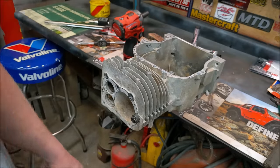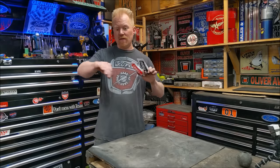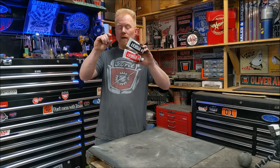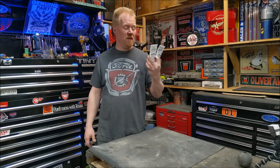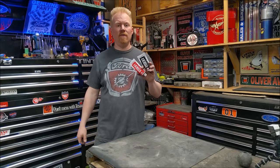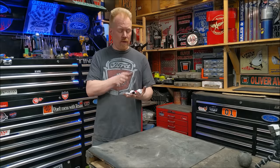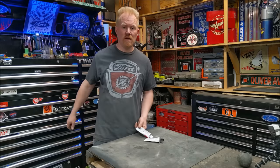It actually does work — if you just had a stripped valve cover with no threads whatsoever and the bolt was completely sloppy, this will give you about 15 to 20 foot-pounds of holding power at one inch of thread depth, enough to hold an RTV gasket. That said, the copper wire trick is definitely better and quicker — no waiting 24 hours for glue to dry. But JB Weld impressed me; I didn't think it would work so easily. Thanks for watching, guys.